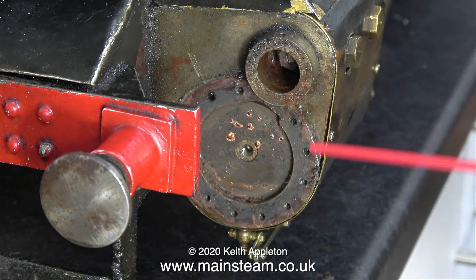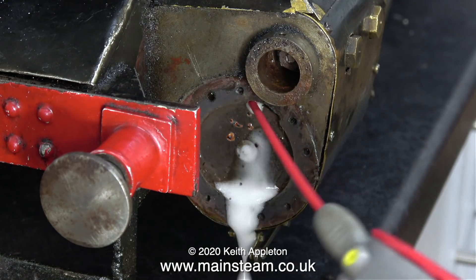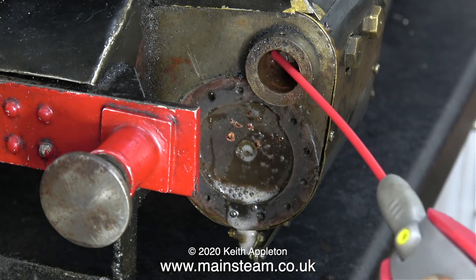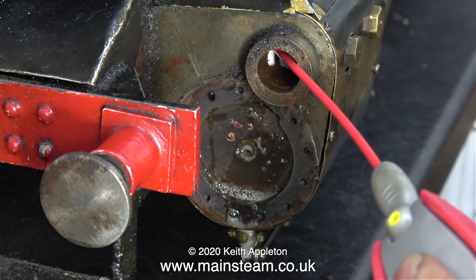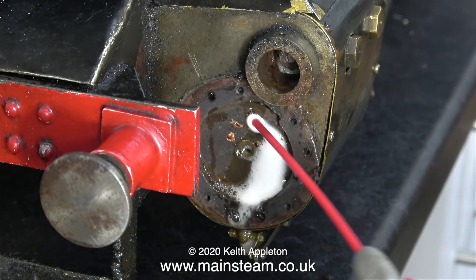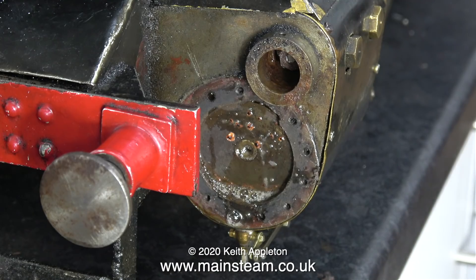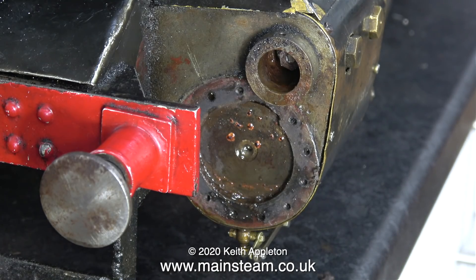So what's the problem? You can see it very clearly — the piston is absolutely rusted solid into the cylinder, and so is the valve. Many times I've mentioned this in quite a lot of my videos: whenever you run a steam engine, whether it's a locomotive or a stationary engine, if it has cast iron parts, run some oil through and preferably some WD-40 as well.